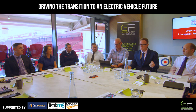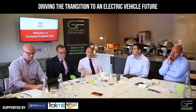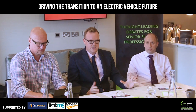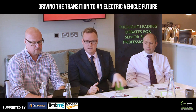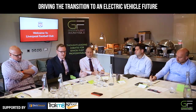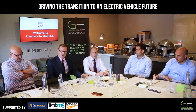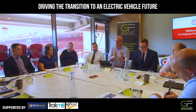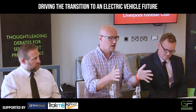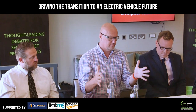Several manufacturers of them, they all come with either a socket or a tethered lead. And they run from 3.6 kilowatts, which is about 16 amps single phase, to seven kilowatts which is 32 amp single phase, but you can three-phase those. 90% of what we go looking for is the capacity and making sure it's available, because otherwise it will fail. The less scrupulous charge point manufacturers won't have done proper service and won't have made sure that everything is in place.